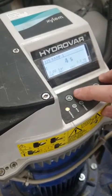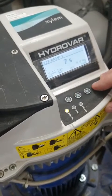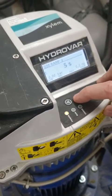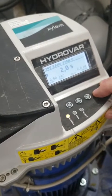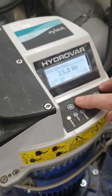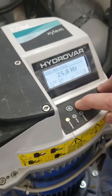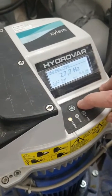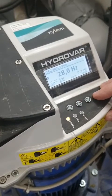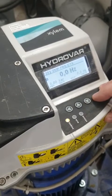Max unit — we've only got one unit so we go to 1. Then we have ramping times; we like to run at 7. Then we go to minimum frequency, which we want at 28 — what we like to run at. If it gets to 28 it will turn off, so we don't end up overheating the motor at low flow.